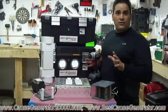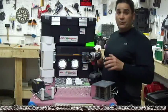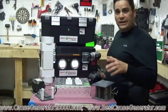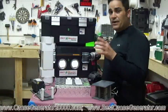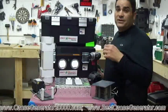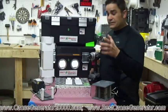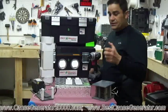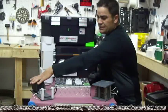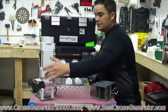If you watched any of our other ozone videos, you've probably by now learned a little bit about how ozone is created. But for those of you that haven't, a quick refresher. Ozone is generated in our machines by high voltage in a form called the corona discharge. That's what happens in nature when lightning strikes and, in the presence of air, converts atmospheric oxygen into O3, or ozone gas. So in this primitive model, you'll see that we have two electrified bolts.